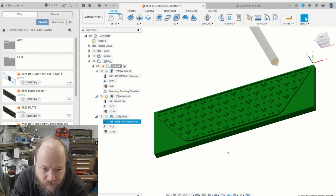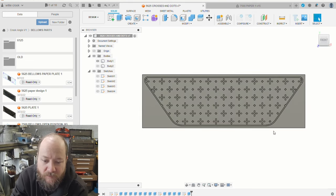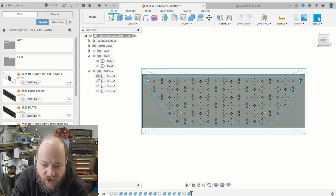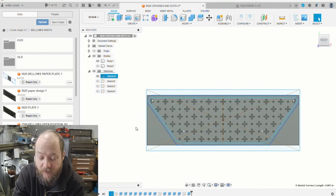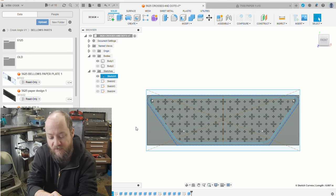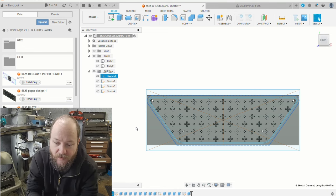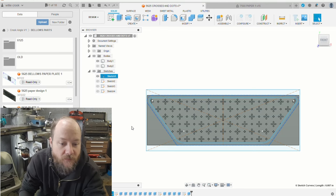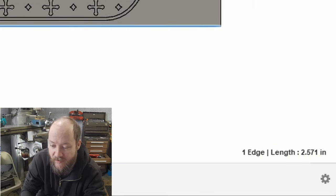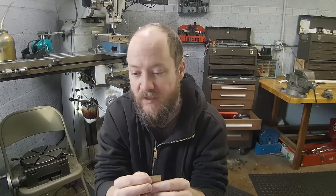One of the important aspects of my design is that the perimeter of the plate matches the shape of the bellows paper itself. You can see this orange construction line that goes all the way around — that's the shape that my bellows paper will be cut out of the steel rule die that I use to cut them uniformly. It's important that the perimeter of the plate matches the external dimensions of the paper, so I can locate them together and exactly center the print on the paper. So the first step is to square up this piece of stock to the exact dimensions of the plate, which is 2.571" long and 0.814" wide.